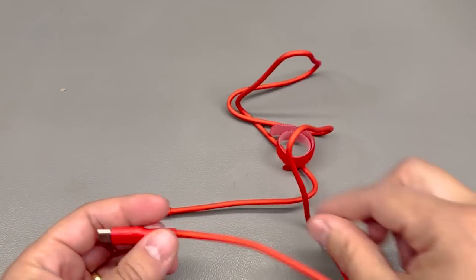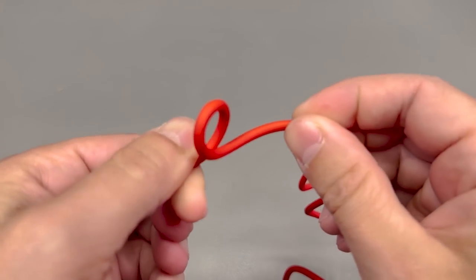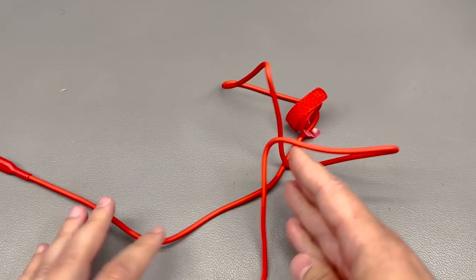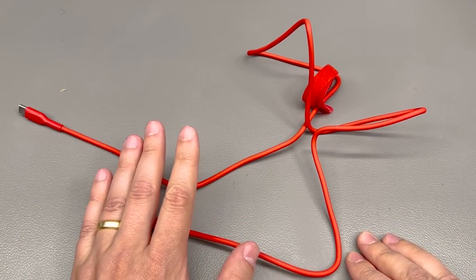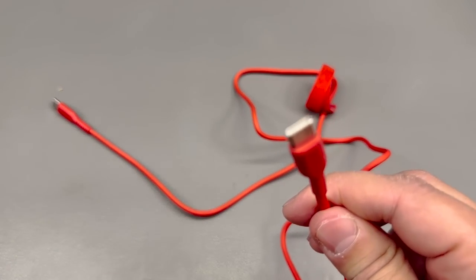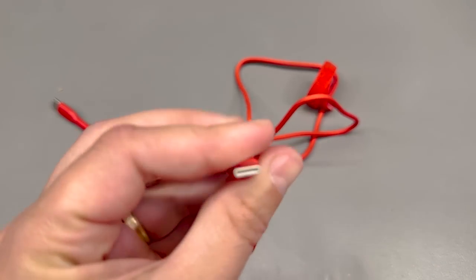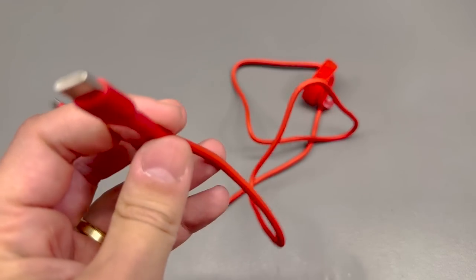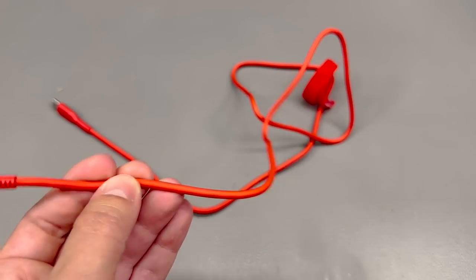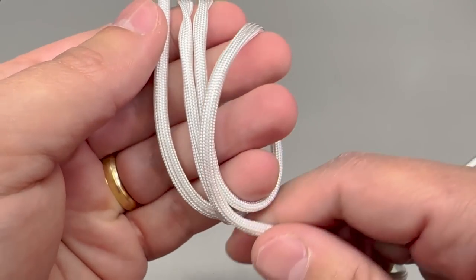While we're in the USB cable category, I might as well show this one — a USB Type-C to USB Type-C cable in bright red. It has an extremely soft and flexible silicone insulation that feels like super high quality. This particular model is sold and branded by Pine64, which makes a portable soldering iron — hence the silicone insulation to protect the wire from being melted by the iron. It has power and data, but it's likely just the standard USB 2.0 data pair inside. In terms of power, I'd expect very decent copper inside since it's intended to be used with their soldering iron that can do 65W on USB Type-C power delivery. I'll probably pack this with my portable soldering iron EVA carry case shown earlier.